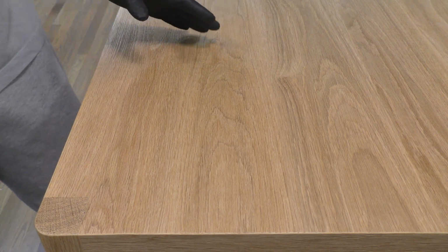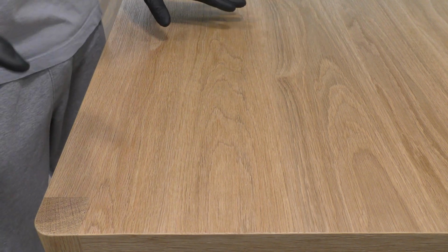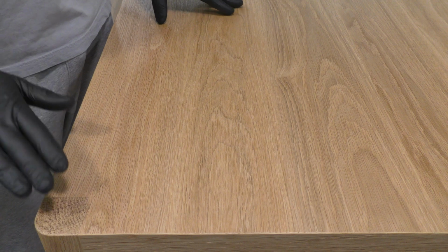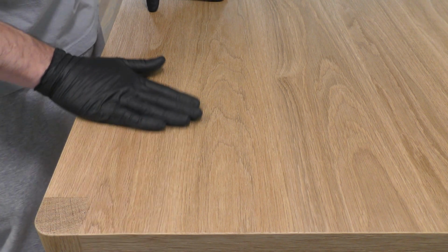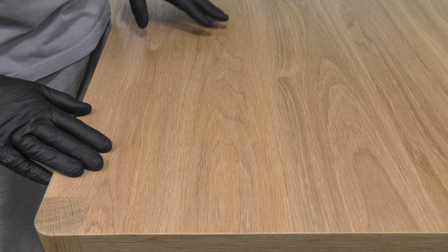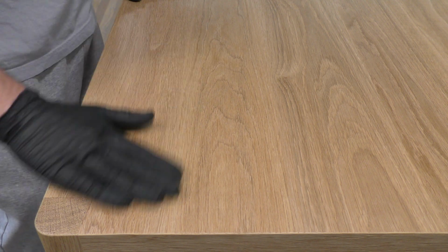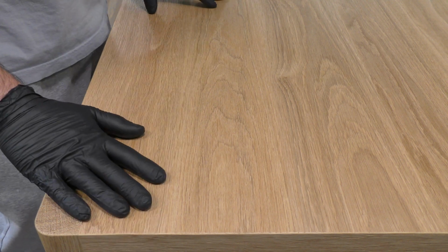And what I do first is I wipe it on, then I wipe it off, and then I clean it with paint thinner on another rag, which will take it off of the surface entirely and just leave it in the grain. And that's what you really want. I've also done nothing to the surface, so I haven't sanded it or anything.